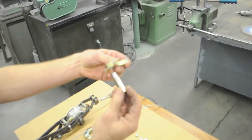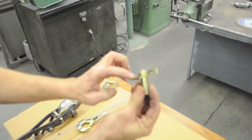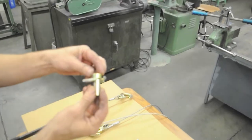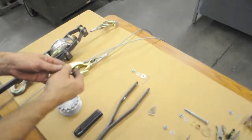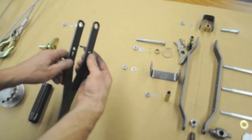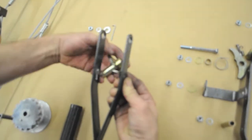the step on the spacer is a little bit longer than the pawl and the pawl adjuster are thick. So I'm going to put a brass washer right there. In fact, I'm going to put 2. You basically want the washers to be just below the end of the part. Okay. Now then, the pawl adjuster is going to sit like this. So if I bring this up through there like that.